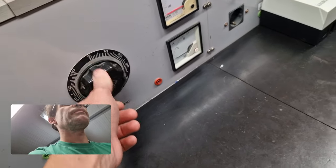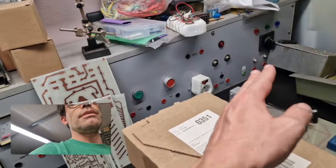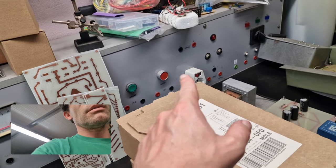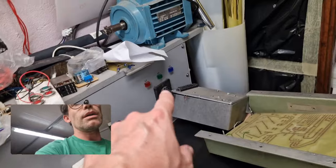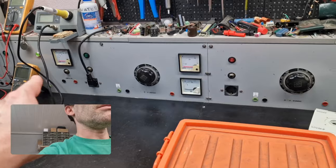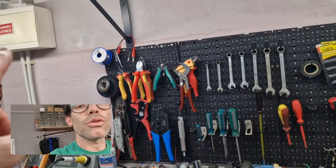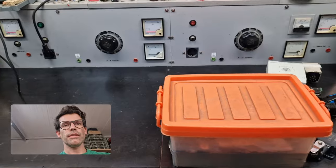Then we've got our regulated zero to 235V AC. From there all the way down that side is our AC, and on the other side we've got our DC where we can go up to 1000 volts DC. We've got our regulator — 310V DC here and 1000V right there. For the three-phase relay it's separated because it didn't fit on that side and we don't have 380V there, so we've left the 380V AC in a separate little space — all properly protected on the circuit board.